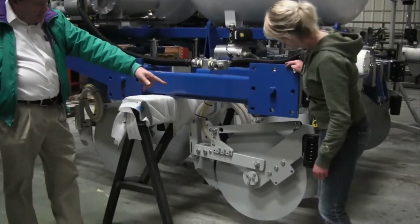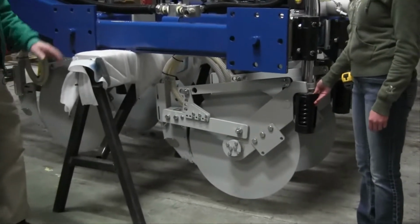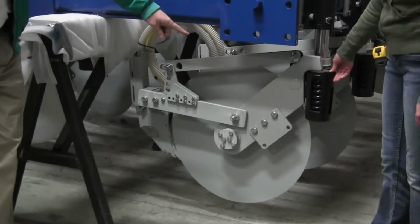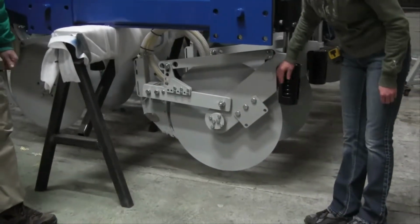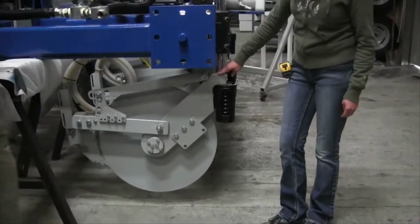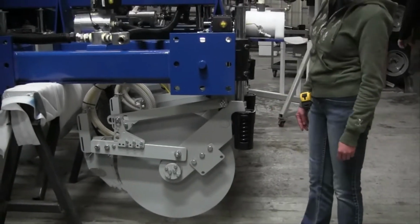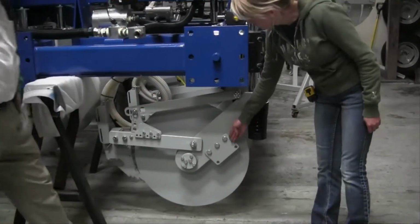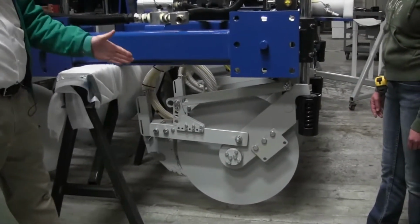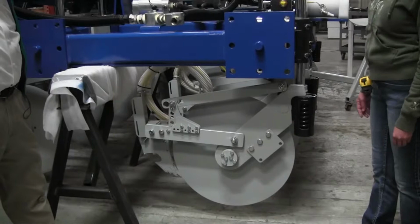So Stephanie, that's the spring right there and the housing right here, pointing to the heavy-duty spring, and that moves up and down, and that's inside that steel housing. And just behind it you'll see where that plate is, where the weldment is, and the pivot shaft for the cross shaft. So the cross shaft is right here, and that's what it pivots around. And just below down there is a bracket that holds the gyro weight if you do not want to run it, or if you want to pack more weight that's unsprung, then you can pack a gyro counterweight in that little tool holder there.